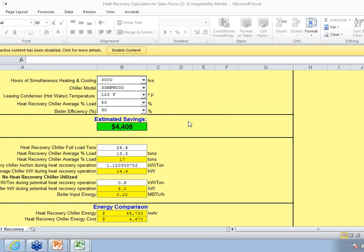So a traditional cost to add heat reclaim to a chiller is typically by chiller basis. I would say on an air-cooled machine it's oftentimes somewhere around, I don't even want to guess at this point and steer you down the wrong direction. It depends on if you're going to do a desuperheater, you're going to do full condensing, you're going to use the air package air-cooled chiller, or you're going to use a chiller that already has the heat reclaim option, so it doesn't cost you anything to do it. So there's a bunch of different ways we can do it.